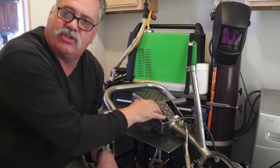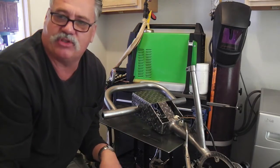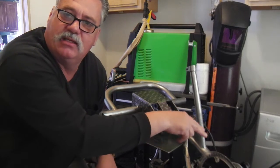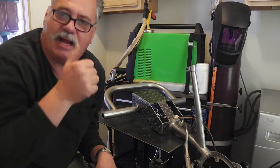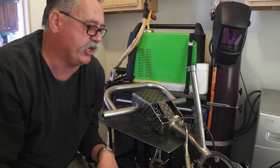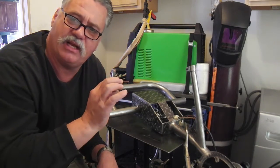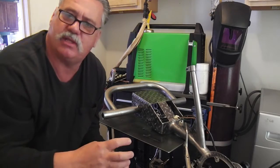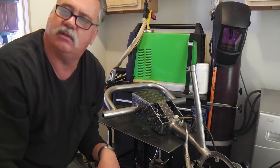So I did that and installed the five-speed hub, but the chain line was messed up — it was off. So I decided I'd fix that chain line. I chopped out the bottom bracket down where the crank set goes through, because it was one of those one-piece crank sets that you can't adjust. They're cheap, old, with cage bearings — not very good, but heavy-duty and sturdy. So I chopped that out, welded in a more standard 68-millimeter bottom bracket, put sealed bearings in with a different crank set, and sure enough the chain line was spot on — all was well.